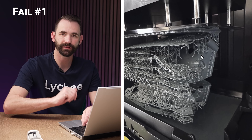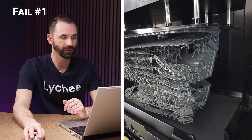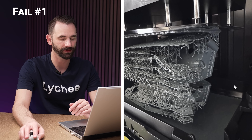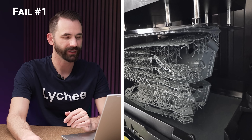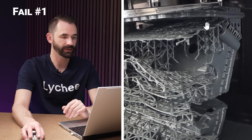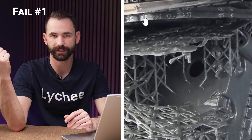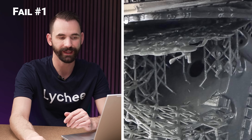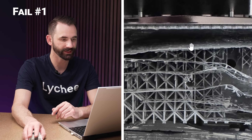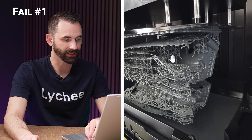Looking at the very first one here, there's a few clues to what's going on. Starting with the printer being used — I can tell by this build plate, this is the Saturn 4 Ultra. We actually know some of the root cause of this one. We can also see these rafts are really, really thick. These rafts are generally 0.7 or one millimeter thick. This is probably edging on 2 millimeters thick or more. Not only is this super thick, but look how much of that raft is piled down below it — tons more raft that printed.